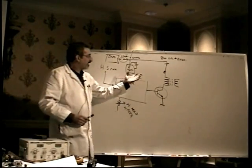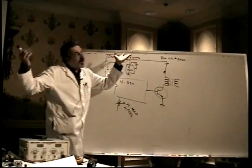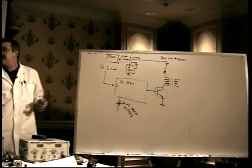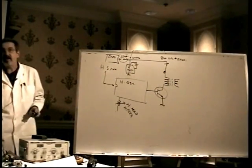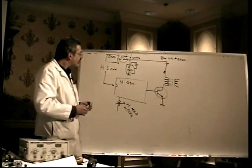A vertical problem causes me to have no high voltage, no horizontal at all. Just be aware of that. It's a little more advanced kind of a thing. It's not terribly advanced. And after you've been working on monitors for a while, it's really a piece of cake.